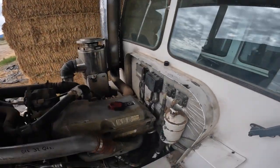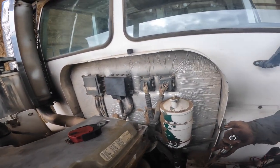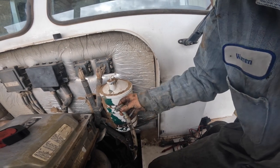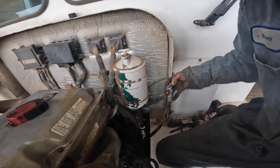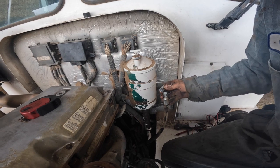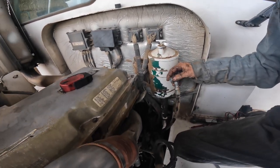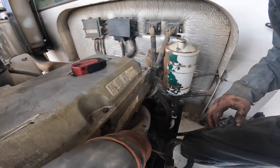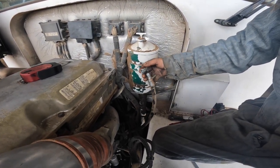I don't know if it's the right pressure, but can I put a gauge on there maybe and see if that is an issue? I could deadhead that and just see, but I'm pretty certain that that's the ECM, and that's what it looks like to me. There's fuel going to it. I don't really know where a guy could check pressure other than teeing into this thing or deadheading the gauge and just seeing what kind of pressure we get.